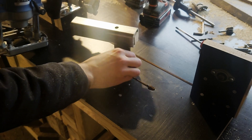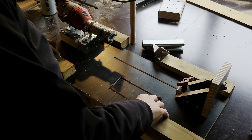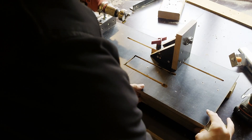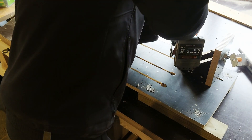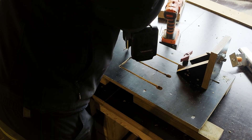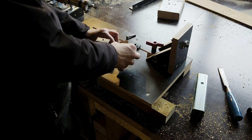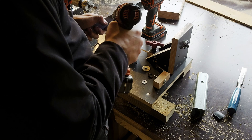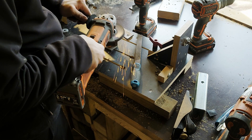After making the T-groove I went back and routed a groove underneath it all the way along so dust could escape when it starts to build up as I'm turning wood. Then I lifted up the whole thing so dust would have some way of escaping the base. The first tool rest I made did not make me happy - it was chunky, didn't allow for angling of the tools, and overall just didn't look good, so I made a new one.